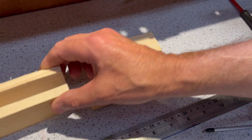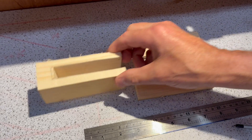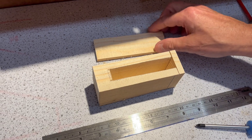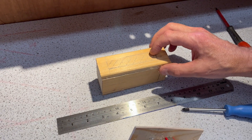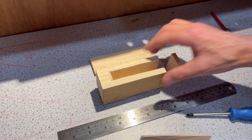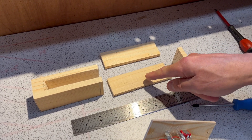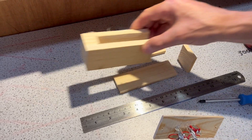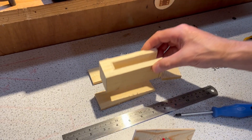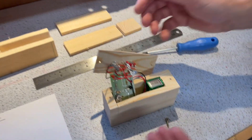So that's the cut there — you cut off the top and the bottom, then you cut out this rebate or hollow. You cut off the end as well — that has to be done. That's the base and it's glued together; I just used PVA white glue. It's important what order you do the cuts. The first cuts will be cutting the bottom and top off, then you're left with this solid, then you cut the end off, then you cut this out.